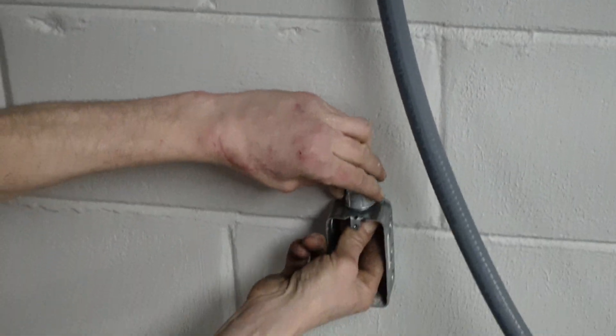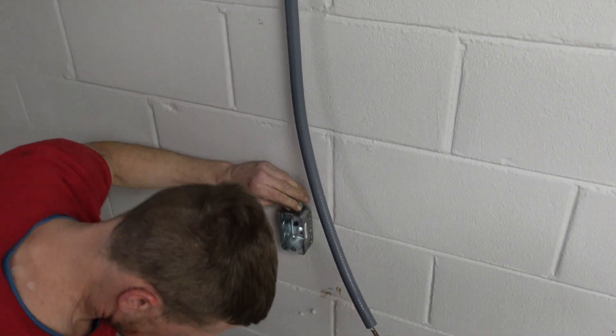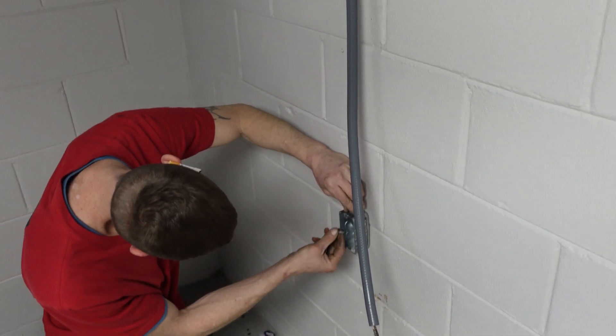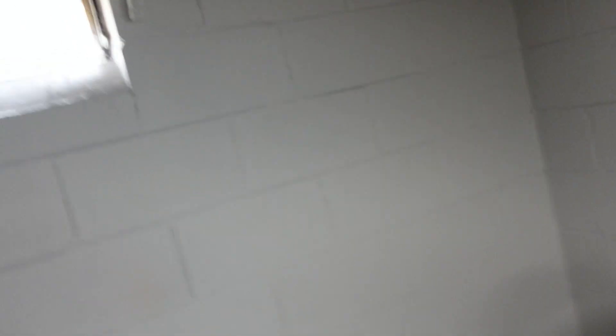We don't have our ground screw in yet. Metal box — got to make sure we get our ground in there properly to bond and ground out our box and our electrical system. So basically that's what we got for you today. We're going to get a couple straps on this liquid-tight flex with the wire going down in it, and there we go — basically got this job wrapped up and everything to code. Everything that the inspector called out that needed to be done, we've got wrapped up here. Another job done. Thanks for watching — subscribe, comment. If you have any questions, put some comments down there and we'll try to answer your questions or make a video about anything you may recommend.